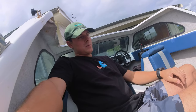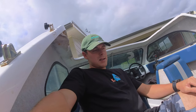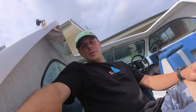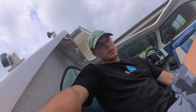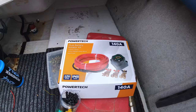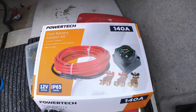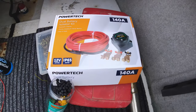We decided to upgrade to a dual battery system because we don't want to get stuck with the old battery not being able to start the motor. The idea is we're putting in a house battery to run the fish finder, radio, and stuff like that — whatever else we decide to put on the boat, including the bilge pump. We've gone for a slightly more premium way of doing it: we'll fit this dual battery isolator kit.